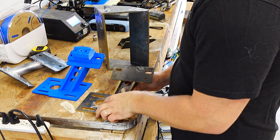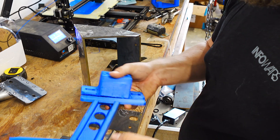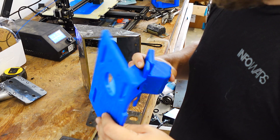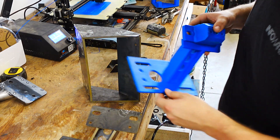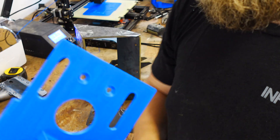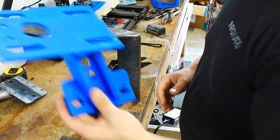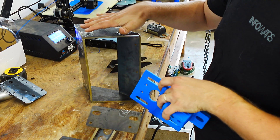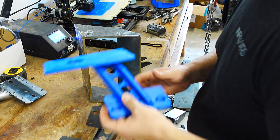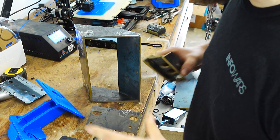The plan is I'm going to 3D print a jig in the shape of the motor mounts, which will be used to make a fixture plate. After I've got that printed out, I'm going to 3D scan it to make sure it matches the model. There are countersunk holes that will be used to bolt it to this fixture plate. So I'm 3D printing a piece to get the fixture correct, welding the fixture together, and then I can produce my motor mounts on that.